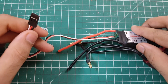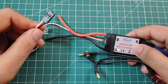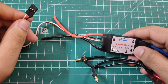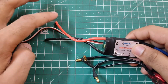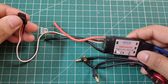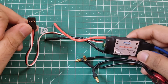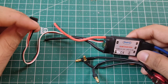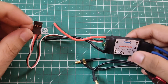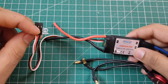There is also a smaller wire with three leads — white, red, and black. The white wire connects to the flight controller so it can control the ESC. The red and black wires are part of the BEC, which stands for Battery Eliminator Circuit. If you apply 12 volts to run the motor, the BEC outputs 5 volts on those wires, which can power your flight controller. Some flight controllers like KK2 can be powered from BEC, while others like Pixhawk need an external power supply.